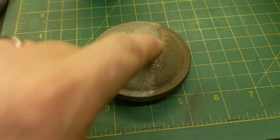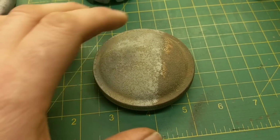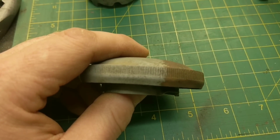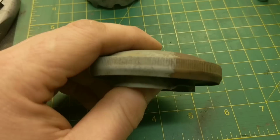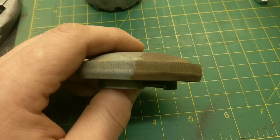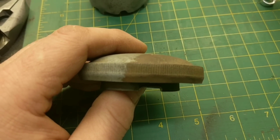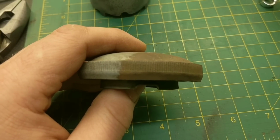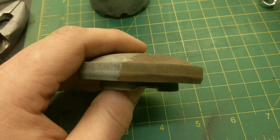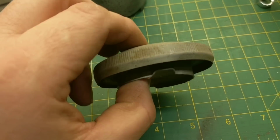Now, I stopped right here at this line, as you can see. But one thing I wanted to point out, and this is where an abrasion cabinet comes in handy, is when you have something that has ridges. And this has these little ridges all the way around it, so you can grab a hold of it with your fingers and unscrew this cap, of course. But having rust inside those ridges is very hard to treat. You pretty much need a wire wheel. That'll do it if you have a wire wheel on a tool or something like that. But you can't really sand it because you'll sand the ridges off. You could use a navel jelly and kind of keep working it in the grooves, and that would work too. But with the cabinet, you can just kind of spray it out within a few minutes and clean it up.